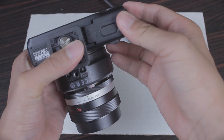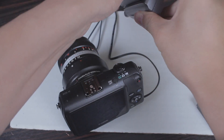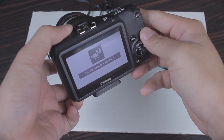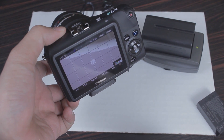Insert the dummy battery, plug in the AC plug through the bottom, attach your Sony NP-F battery — a little light should shine and there you go. Congratulations, you have now made your own DIY external battery pack.